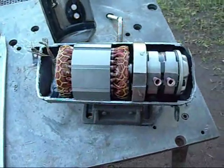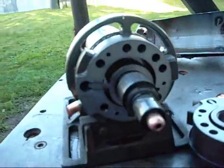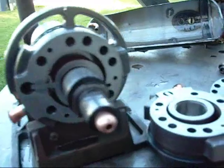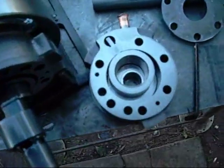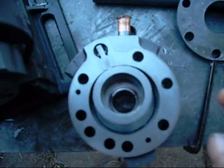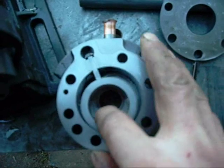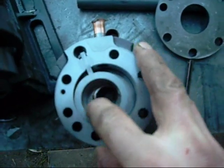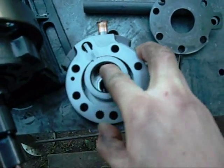I'm going to pull this one apart and show you just how it works. What this here is, is Daikin's award-winning swing compressor — it is not actually a rotary compressor. It looks like a rotary, but they've basically taken it to the next stage by keeping the seal a part of the rotor, so that it simply swings around between these 2 little blocks. Very low losses, very energy efficient.